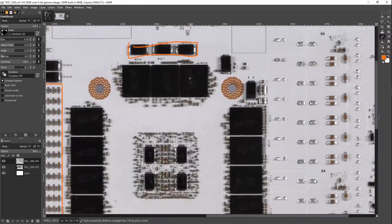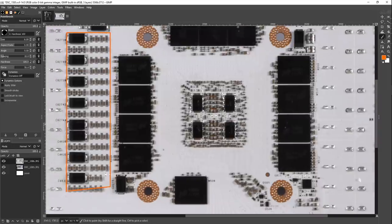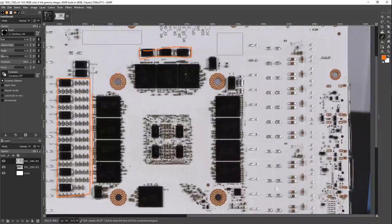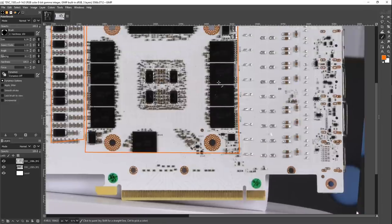The memory filtering is completely loaded. The interesting thing about memory filtering on NVIDIA GPUs — and I think this also applies to AMD GPUs — is that add-in board partners aren't actually allowed to mess with a square of the PCB. You're basically not allowed to customize anything in that area. So you can't add extra capacitors, even though there might be space. There are a lot of things you might want to do to try and improve the power delivery — you can't. NVIDIA controls that area. You have to use the NVIDIA standard for that.